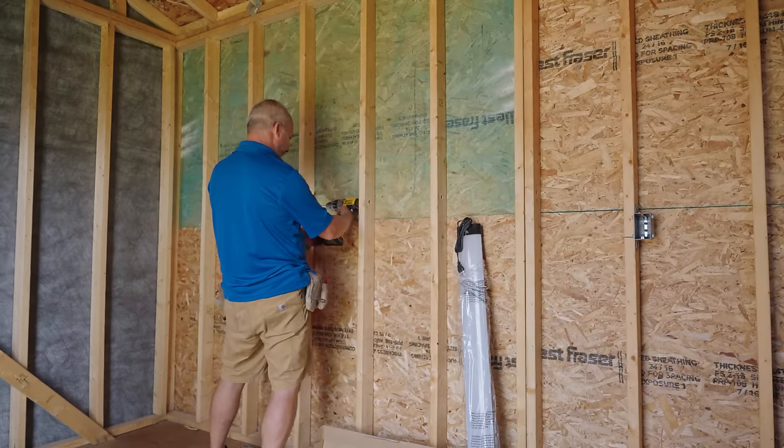Secret here is these little tabs, okay? These little tabs go to the wood, and then the wire's got lots of room. Here, check this out, okay? The wire's got lots of room. So it's held in position, but it's not compressed into the wood. You go look at houses that are wired in the 50s and 60s. They beat the living tar out of these things to push the wire right into the wood, right? It's a real pain in the butt. And it actually increases the heat in the wire and is one of the reasons for all the fires that you get. So, we've learned a lot in the years.